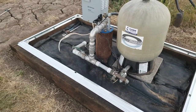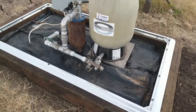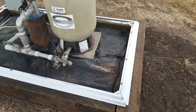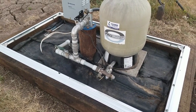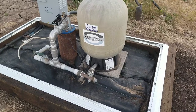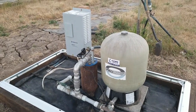This is the base of the pump enclosure. We bought a fairly inexpensive half metal shed from Lowe's and put a base in here using old pressure treated six-by-six lumber. I backfilled around it after getting it leveled out, then put some fabric cloth over the dirt. I'm going to get some pea gravel and put about an inch or two in there, which should be pretty good for keeping the mud and stuff out.